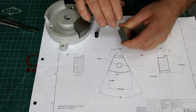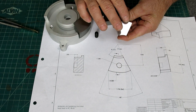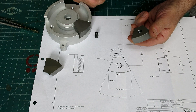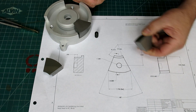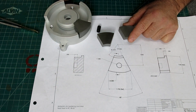At some point we'll get to the lapping of the tilting pads themselves. These are A2 tool steel, heat treated at about 60 Rockwell, and then lapped flat — pretty damn flat. So let's go do some machine work.